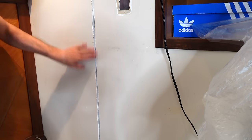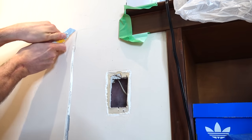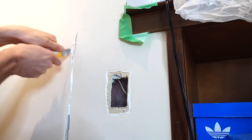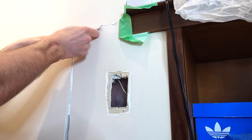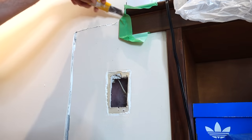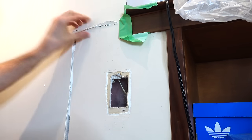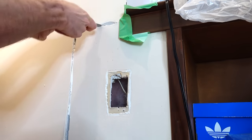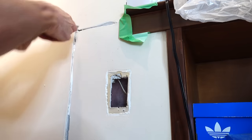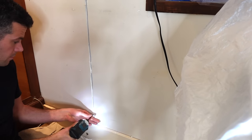Alright, the joint is nice and empty again. This little space is going to be one of the parts of the office that I film in, and I just didn't want to be looking at this mesh tape crack on camera all the time. So, now we can get some mud in there. But before we break out the mud, we've got to solve the root of the problem first, which is poor fastening.